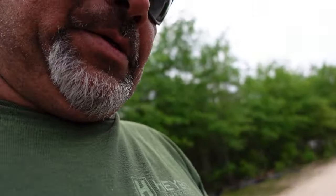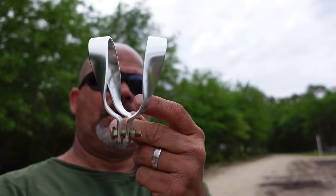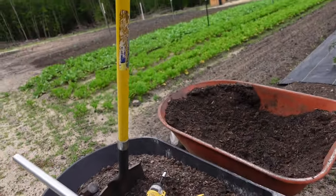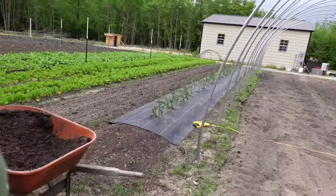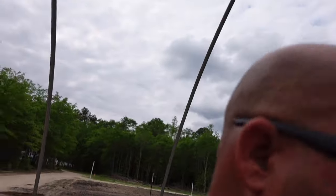I open up my straps and this will give you a better idea of what they look like. Just bumped that mic — if y'all got some background noise I apologize. So basically they go up like this, just like you see it. This way it's sitting on the purlin, this way the tube's running through it just like that. So what I'm going to do is carry this up — in a nutshell we're just going up and making a saddle for this pipe to sit into.